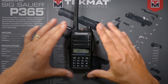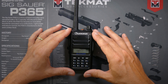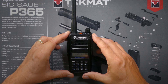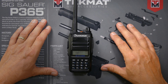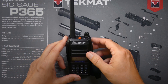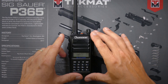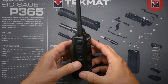Affiliate link below. This is a GMRS radio, which means you do need a GMRS license to transmit. If you're only listening or scanning, you do not need any license. Because it's a GMRS radio, it can only transmit on the GMRS channels, but it can receive everything from 400 MHz up to 480 MHz. It comes pre-programmed with 251 channels from that 400 to 480 MHz range — those are all government agencies and emergency channels.